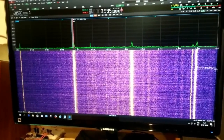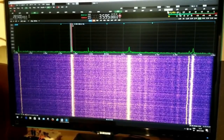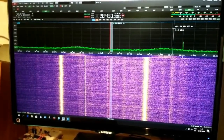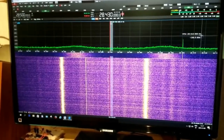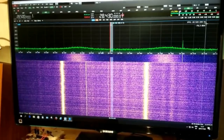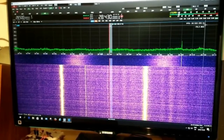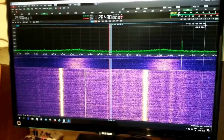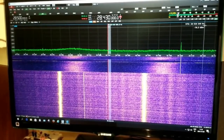However, if I go to 28 MHz instead of 3.5 MHz, the situation is somewhat different. Now there are not so many discrete signals, but the noise level goes up and down — sort of broadband noise. I will also show that the level of this noise is dependent on the mode of the amplifier. If I press it off, the level more or less disappears. And if I go back to operational mode and change the power level, this will also somewhat affect the spurious emissions.